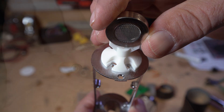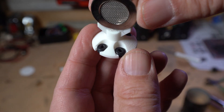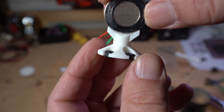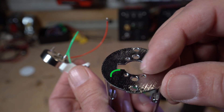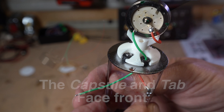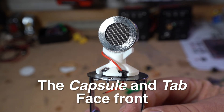Slide some little rubber bumpers — grommets — on here. We're going to run the wires through the ones that are not tapped, and the screws will go into the ones that are tapped. The screws are in place and there's still a little bit of an air gap, which is perfect for vibration dampening.